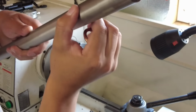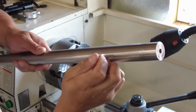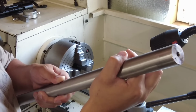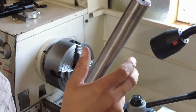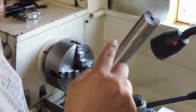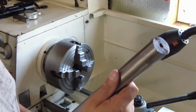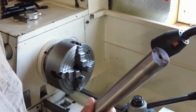So I'll have this thing sticking out roughly this much. The 6 arc will land about right here. This will be right here, so all the clamping force is actually right in front of the chamber itself. Now, just a little bit of pressure actually will cause the stainless steel, this is 416R stainless steel, to actually crush a little bit. So when you're running your chamber reamer in there, it in fact does kind of change the measurements as well. Heat does play an effect of that, so that's something else I monitor, and I'll show you guys the process of that.